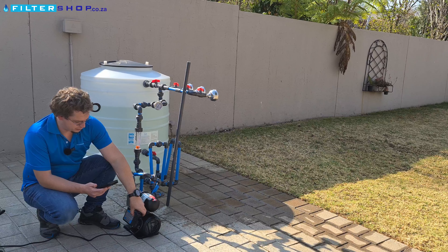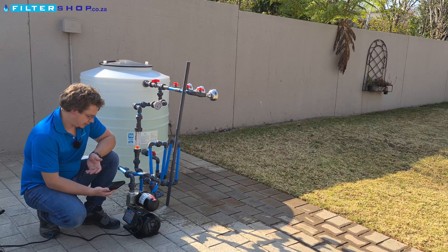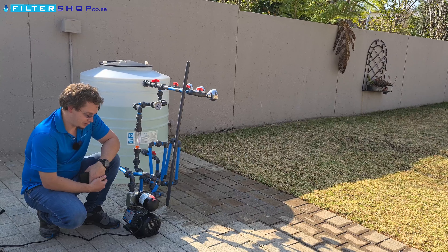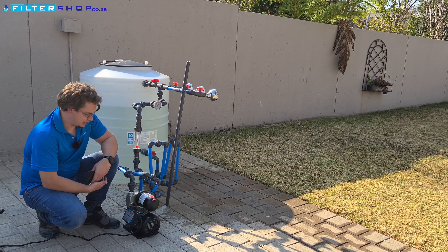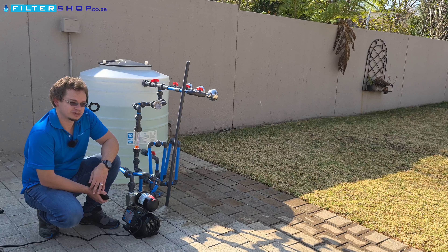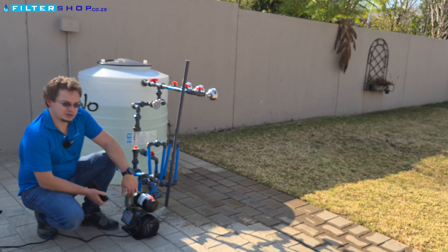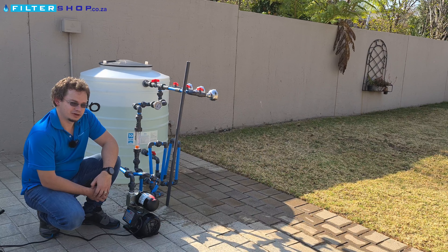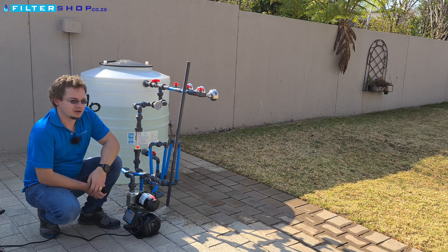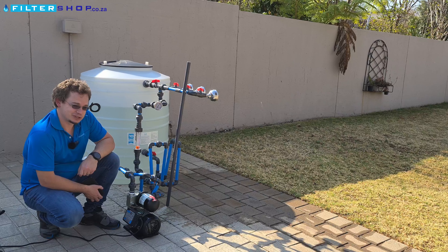So it's a nice little pump but it's only really going to work at lower pressures. That means you can't really use it if you want to pump through filters, as you need a higher pressure pump for any kind of filtration. Another downside is the cast iron head — you can only really use a cast iron pump if you've got high hardness water or water that has a tendency to scale. If you use it on rainwater or even normal municipal water it will rust and you'll start to get rust through into your distribution system. Very nice controller, but underwhelming results unfortunately.